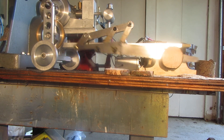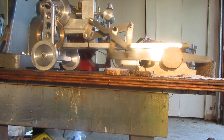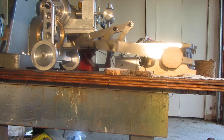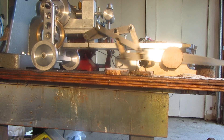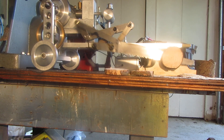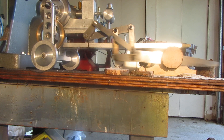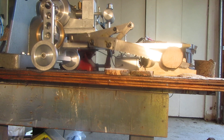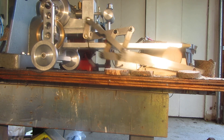I looked around and tried to find a softer piece of wood, but I wasn't successful. There isn't anything really handily available that's softer than dry spruce anyway. And this tree had been dead for the last year, I knew that. So we're making our way through there in good style now. The theory on this stuff tells me that the blade only cuts when it's pulling towards the engine, but what I'm seeing is a bigger pile of sawdust on the side opposite, away from the engine.